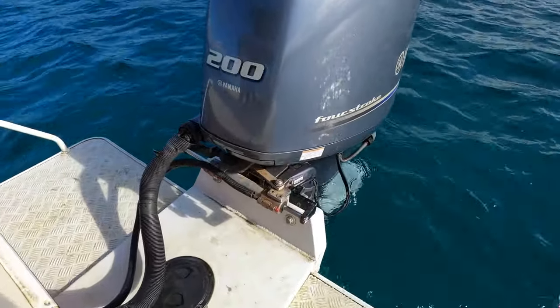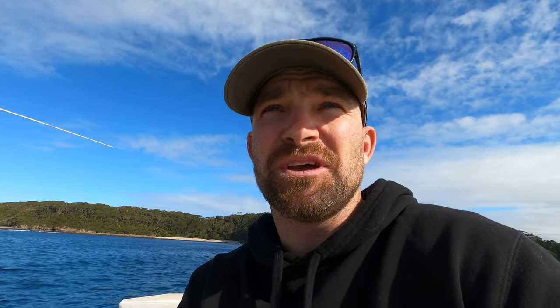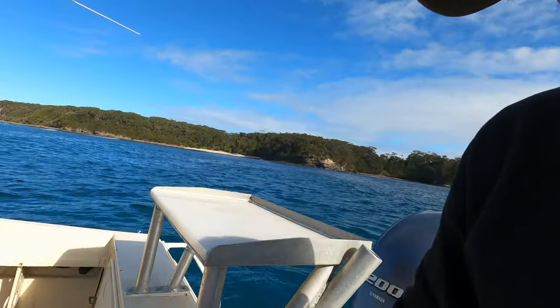The boat's got a pod on the back. In my opinion, pods were never meant to be on these boats — it changes the waterline length without a hull extension underneath. Moving the engine further back changes the weight characteristics so the nose lifts more, causing porpoising. This boat avoids that with a Perma-Trim hydrofoil, but if you have to fit one of those it means something isn't right. The pod also ruins the handling in turns — instead of banking in nicely, it turns like a pig. We're probably going to remove the pod and make the transom section a flat back.